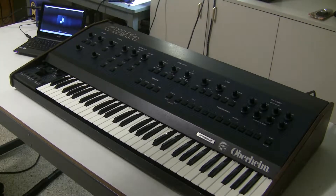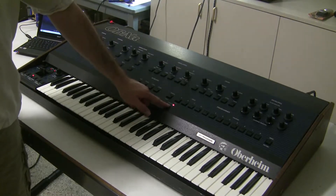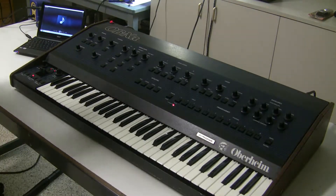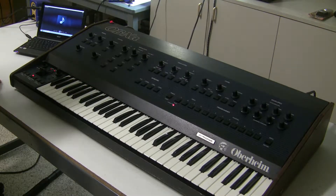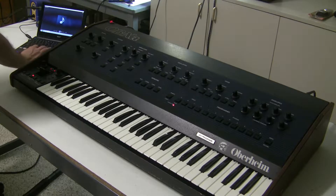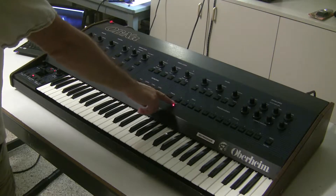The connection is made and the switches are set. Now we're going to turn on the keyboard, and the cassette LED will light up indicating that it's in cassette mode. Now we're going to play the factory WAV file, which you can download through the link in the description of the video. When we hear the leader tone, we're going to hit the play button.